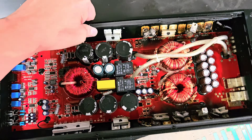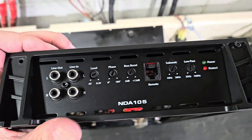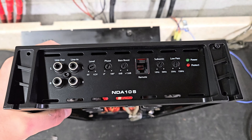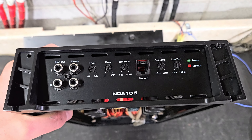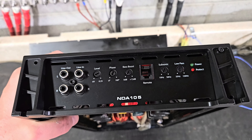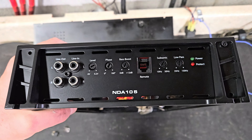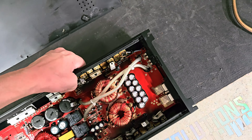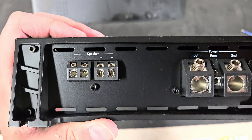These are probably rated at 14.4 volts, though the manual doesn't specify. We'll keep going into uncertified — if voltage dips too low I might kick a charger on, but we'll try to blast through it. Uncertified is the exact same testing, but the dyno keeps reading even with distortion or clipping present. Starting 4 ohms at 14.68 volts — rated 780 watts. Result: 885 watts into 4 ohms, dropping to 14.54 volts.